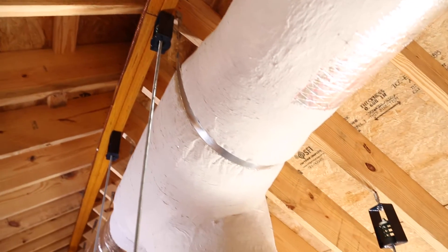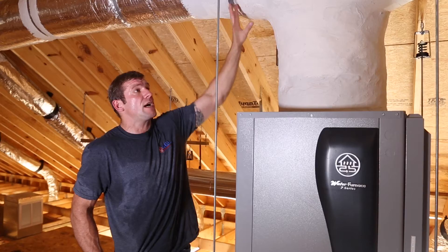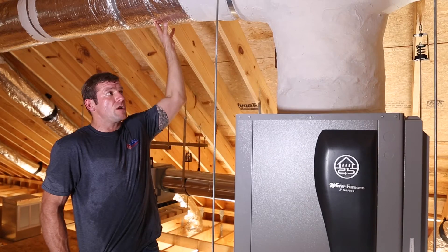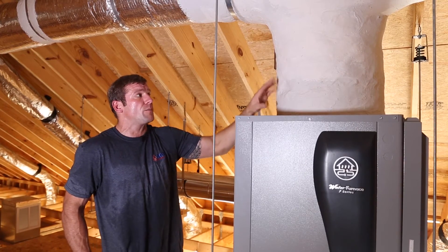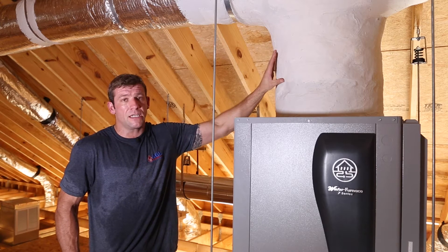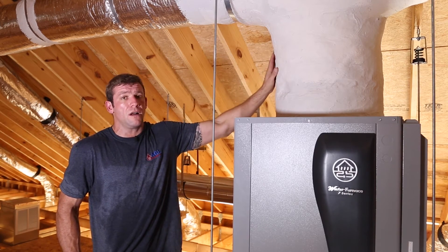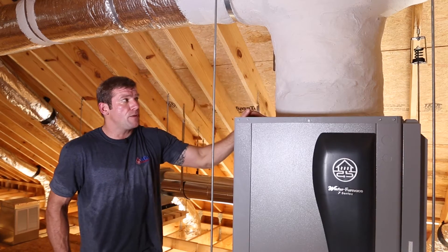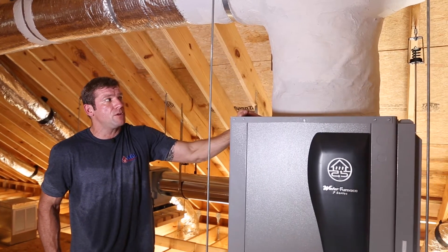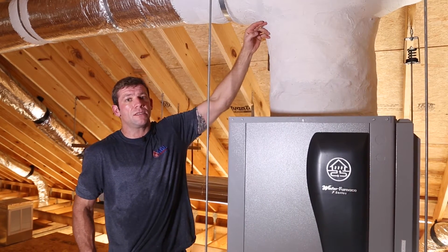Anything you attach to the equipment will also transfer vibration. This ductwork will transfer the vibration into your structure. So what we've done here is put a brake joint underneath this insulation. This can be flex duct or a canvas connector — there's actually a brake joint here under this insulation and if we push this unit you can see that joint moves with the unit, which will cancel any vibration transferring up into it.